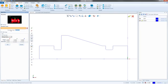So I'm going to go with 360 degrees. Now, the only thing about this, and I didn't put the hole through the center because we could drill it. There's a bunch of ways we could do that. But with this, I don't want to pick this middle line. The only time I'll be willing to pick this middle line is if it's a hole. So an example of what this part's going to look like without the hole in it would be you'd start on this side here and you'd chain all the way around to this side here, but you will not use this middle line. So I'm just going to click here, follow this chain to the end of the last chain.